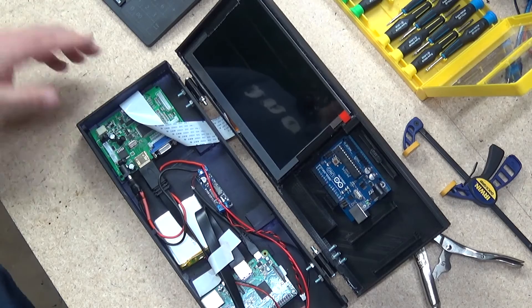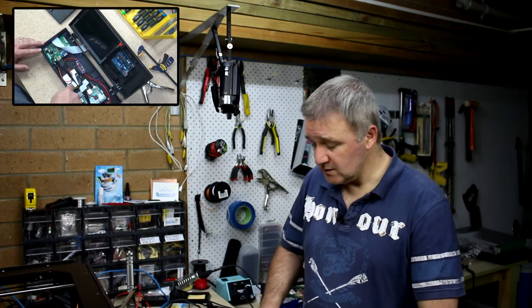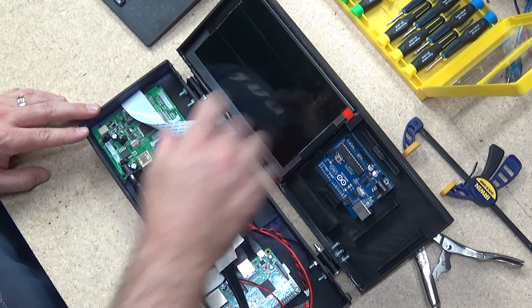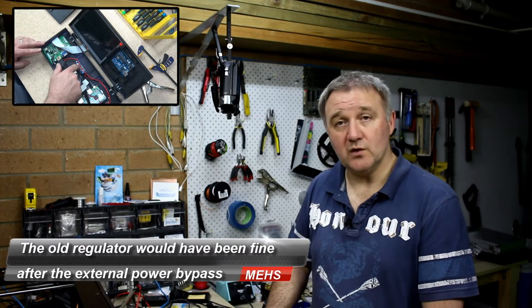The general design was pretty much what we talked about last time. I've got the SparkFun board running to a battery — I had to use a smaller battery. That HDMI cable is a beast; those flat HDMI cables, even though they're only 30 or 50 centimeters long, as soon as you need to put a kink in them you're stuck with the full height of the cable at different angles, so you can't get it to go where you want — it ends up being a problem. I've had to go for a smaller battery because the slightly larger one wouldn't fit with the cable. I ended up putting the driver board in the bottom part of the case to make the top part thinner. Raspberry Pi 2, running Ubuntu, running fairly well. I changed to a 5-amp Pololu power regulator because the previous one was getting too hot.